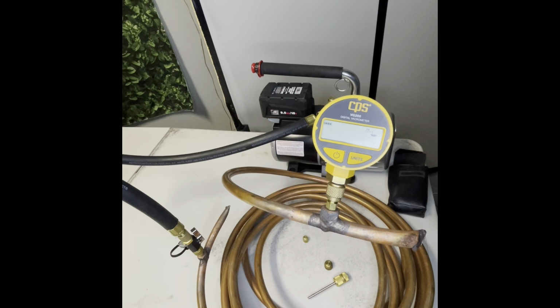get a stopwatch going so we can see how long this thing takes to get down to 500 microns. Don't forget, I didn't purge nitrogen through this. This roll of copper has been sitting in the elements for God knows how long. You can see how it's discolored. And I didn't flow nitrogen soldering all this stuff up. I did pressure test it. So let's go to stopwatch.